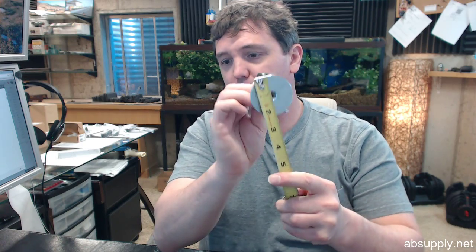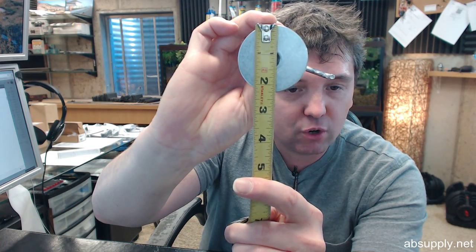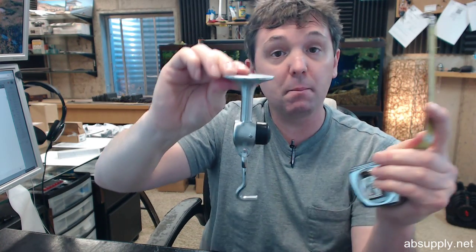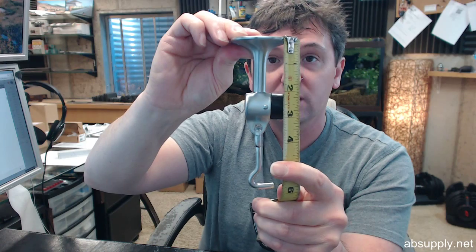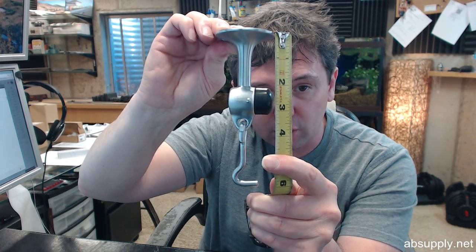Now let's get some dimensions. There is a link below this video to a document called a cut sheet, which shows you what this would look like if you were to tear a sheet out of the catalog. They don't give a lot of dimensions, but let's define them now. The base diameter is 2 1/4". The bumper contact is 2 5/8" — I am going to measure it upside down so we can clearly see the center line of the bumper, which is where they get that dimension from.